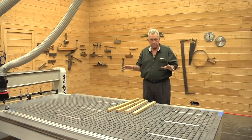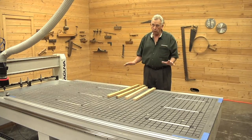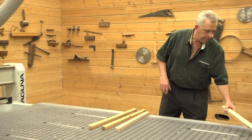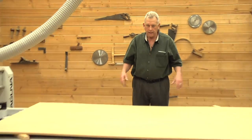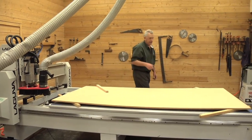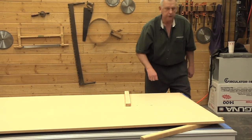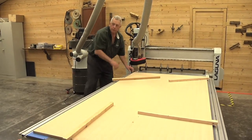Once all our gaskets are in place, we're ready to put the spoil board material on — a piece of three-quarter inch MDF. What you don't want to do is lay the board on and push it, because it may cause the gasket to roll out, giving you a leak you won't know about until it's too late. An easy way to get around this, especially if you're by yourself, is to get four scrap pieces of wood and lay them diagonally on the corners. With the panel on top of those four supports, once it's lined up the way you want, simply pull one board out at a time so it drops down. That way you don't move the gasket.